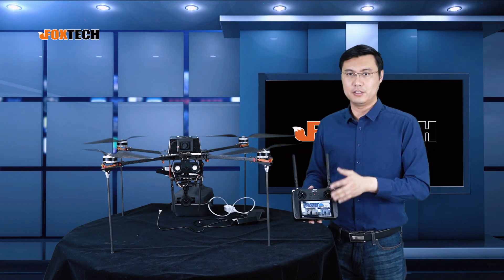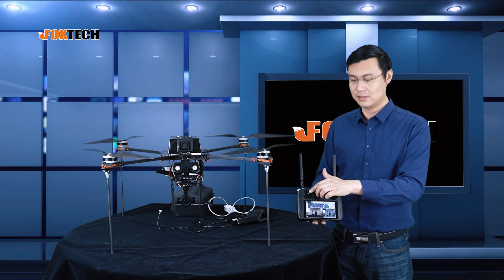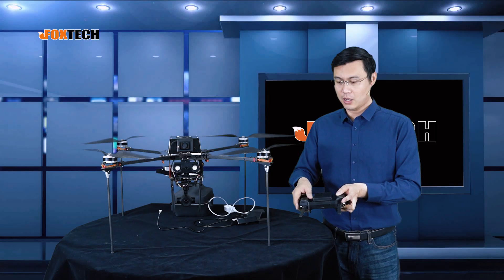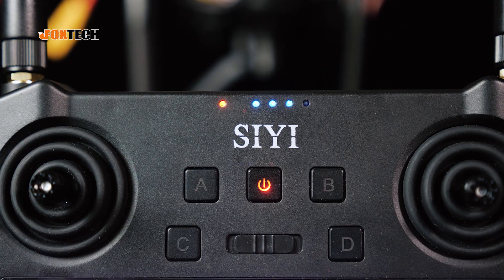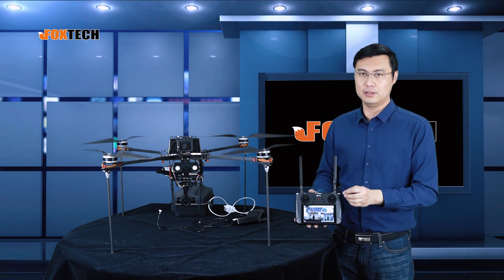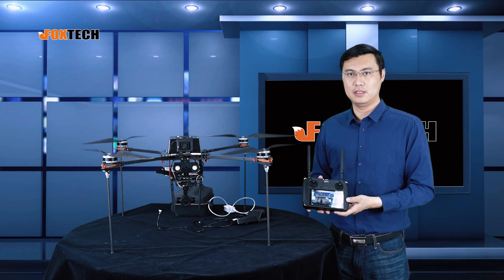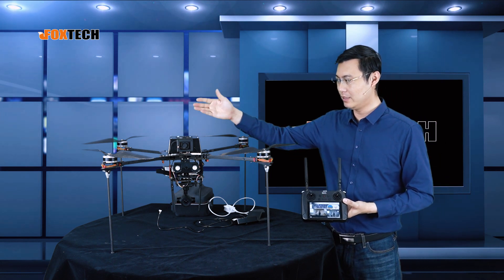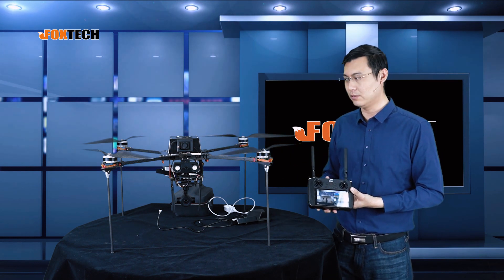You may wonder how we can control the drone with the MK15 radio. You can see there are two drive sticks and two three-way switches, and here are two wheels. It comes with 13 mechanical buttons, switches, wheels, or sticks as mechanical channels. You can use up to 16 channels, and it comes with S-bus so we directly link this radio receiver to the flight controller to control up to 16 channels.